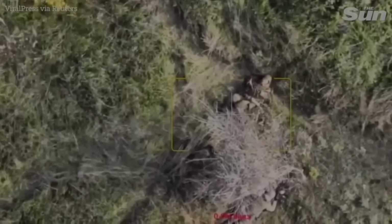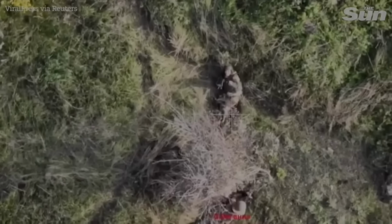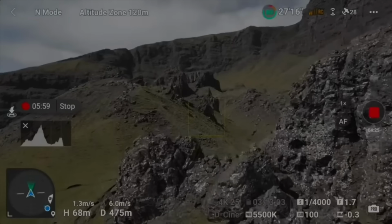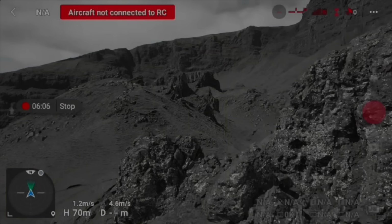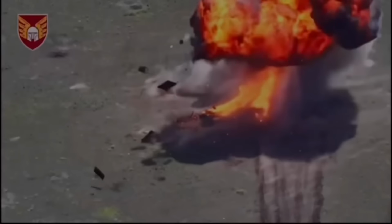And then we have digital. And digital is really useful for recon drones like Mavics, or maybe bomber drones. But the problem is that it doesn't decrease in quality. It never decreases in quality, it just cuts the video. So if the video cuts, you don't know where you're going anymore. Where with analog, you'd be able to direct the aircraft. Because usually the video is going to be the first thing to cut. The radio signal is pretty good. But the video, I mean, it's a lot of information you're putting through this frequency.